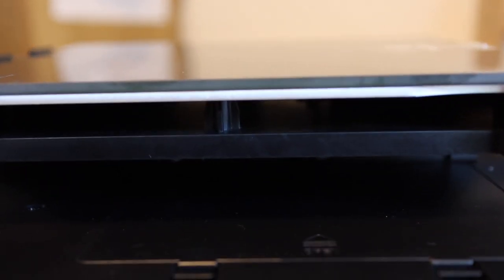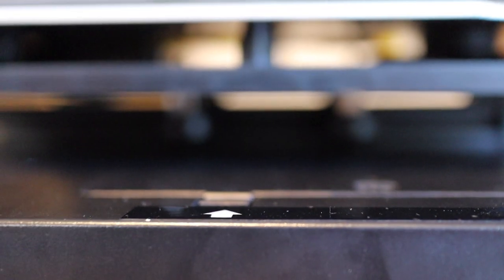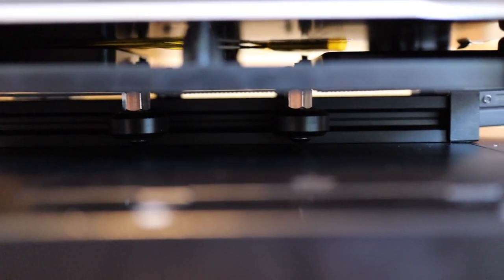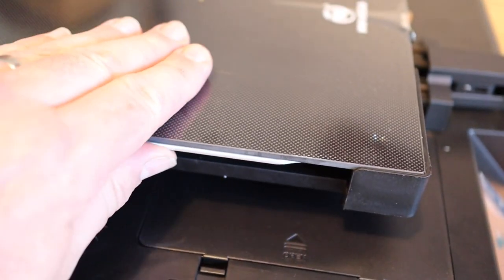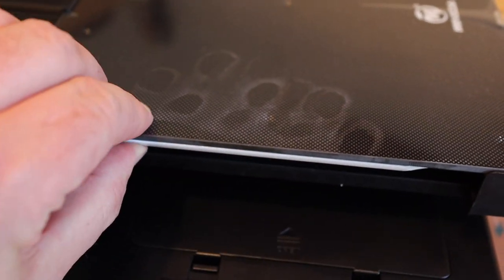There's the touch screen, and there are eccentric nuts underneath so you can adjust those and get the bed running nicely. You get a spanner for doing that - you just tweak them so they're running smoothly and there's no play on the bed. You don't want them gripping too tight but you don't want the bed moving.